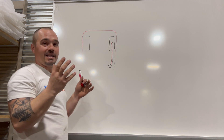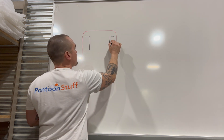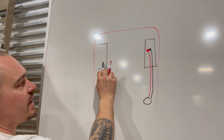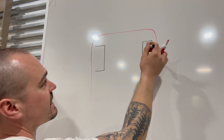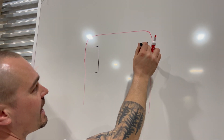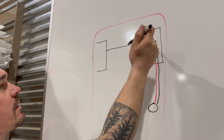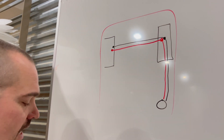Those came into a connection with my LEDs right here. I have power and ground to that LED, but I also have an LED strip on the other side that I need to get power to. It's as simple as taking another strand of wire — another 16 gauge or 18 gauge — and splicing it in at that same connection and running it underneath the boat across for my ground and across for my power, then splicing into the LED lights on that side too.